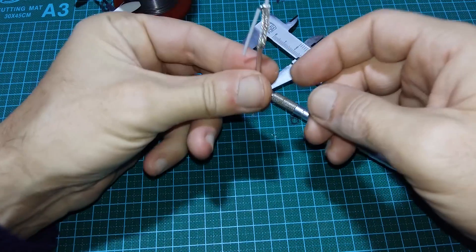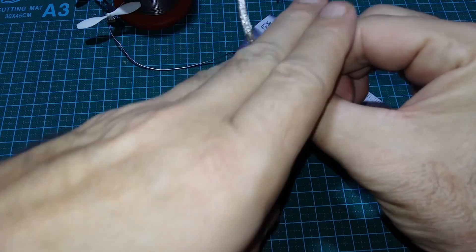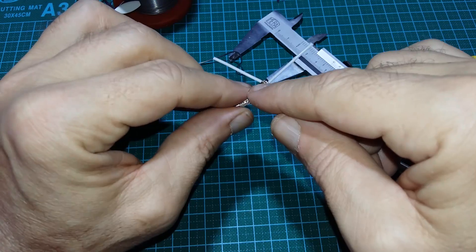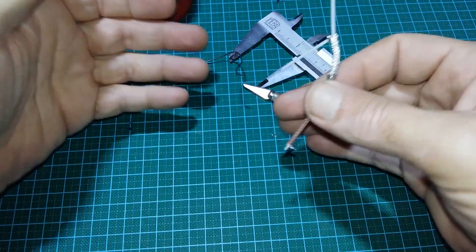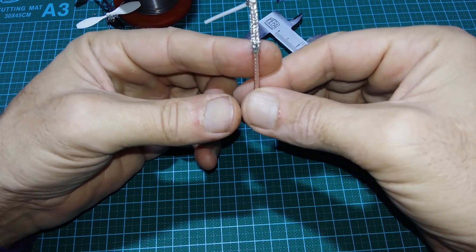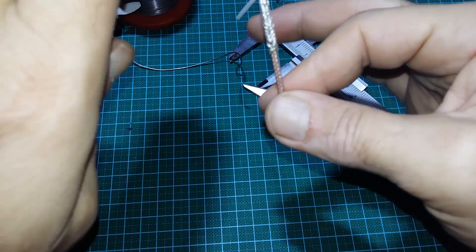So this is the antenna for a quadcopter. If you want an antenna for a remote controller, bend it like this and insert it — make a hole, there is a cover, a little bit tricky, or you can add this part later. Please secure with hot glue or epoxy, because of transportation it will move and fall, and you will have to solder again. In case you lose this part, it will just act like a quarter wave antenna, which is not bad at all. For maximum range, I want the V-shape antenna pointing in the direction of flight. I got 1.1 kilometer range and I bet I can get a little bit more.